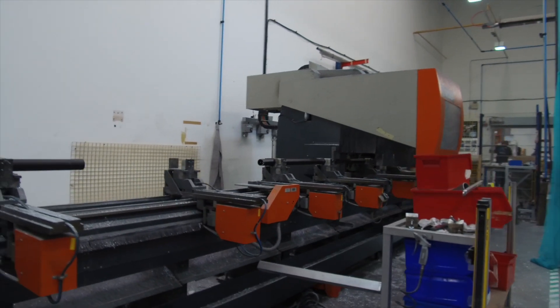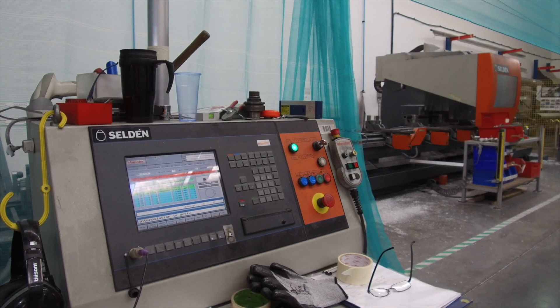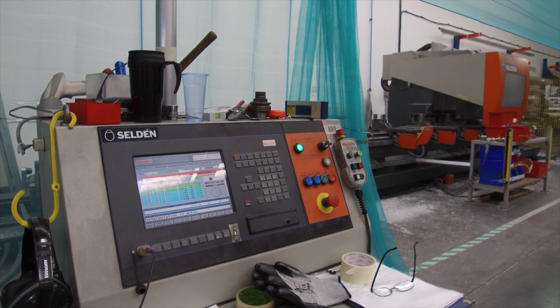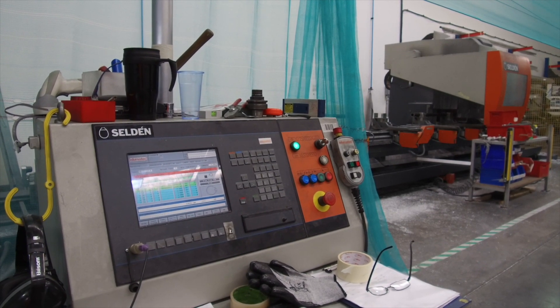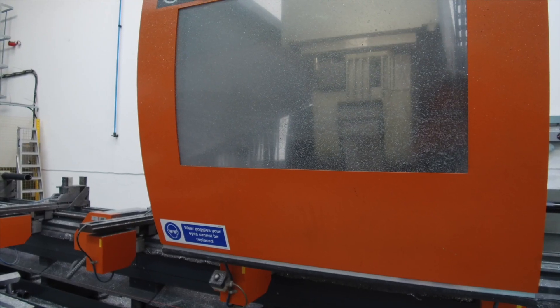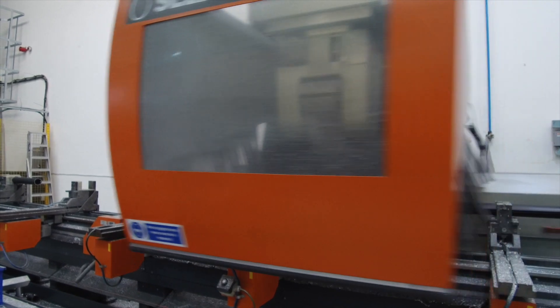The cut is then re-welded — that is done on a computerised semi-automatic welder, and the machine is laser aligned to ensure that when we weld the taper together we're welding completely straight, so that the top mast will bend in the same way side to side.